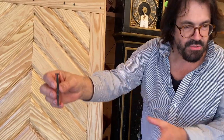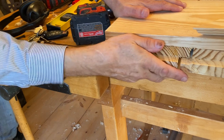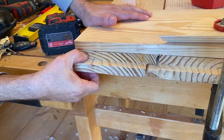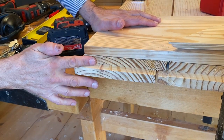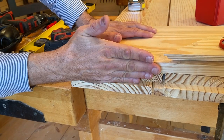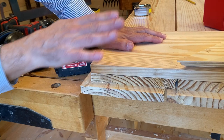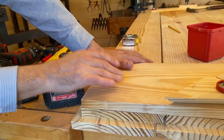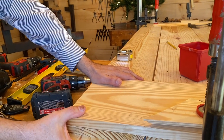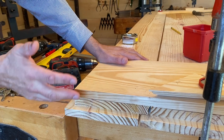This is essentially two doors in one. This is a plank door, tongue and groove going across the bottom, about an inch and three-eighths thick. I rebated this out, backed off, and actually the door is going to close and hit the frame here, at the rabbet. Then you build the additional geometric door on top of that. This thing weighs absolutely tons — it's going to be around 80 to 95 pounds when done.